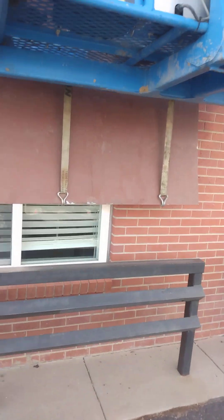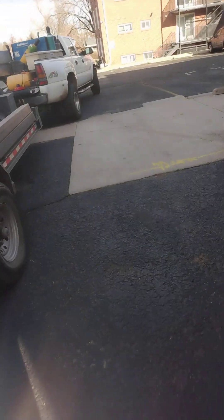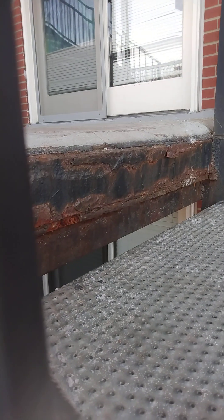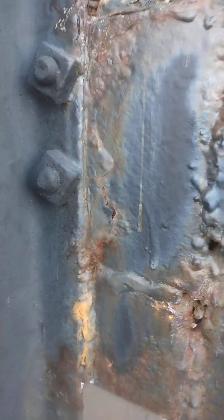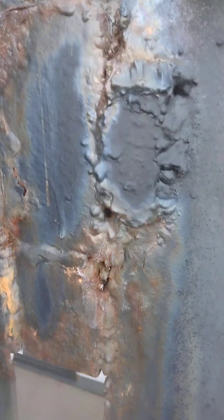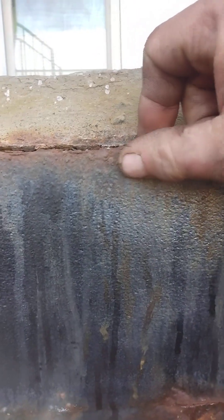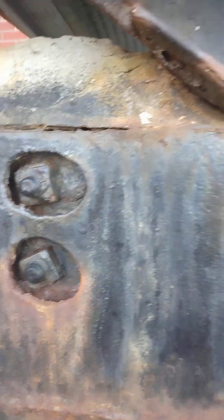This worked out pretty good - just hung a couple straps on the man lift, hooked the sheets on it, and ran them up. There's a ton of work here too. You gotta redo a bunch of stuff - this building's been band-aided like three times. I can stick my pocket knife through that caulking, already done it. Look at these fine welds somebody did - holy shit, obviously nobody knew how to weld. Everything's running behind the steel plate here so it's just rusting everything out. This is a plate somebody put on top of another one, so it's been band-aided at least twice if not three times.